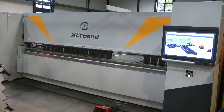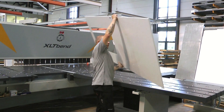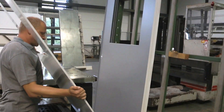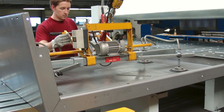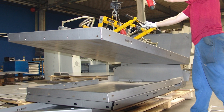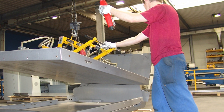There are even many solutions to unloading and stacking completed bent parts. Light components with all four sides bent usually become so rigid that the machine operator can unload and stack them without assistance. For heavy work pieces made from thicker materials, there are a variety of suction-based solutions that assist with lifting and placement of completed components without additional personnel.